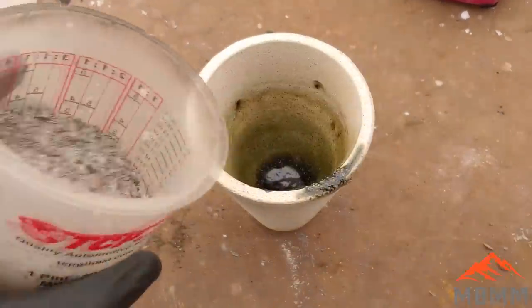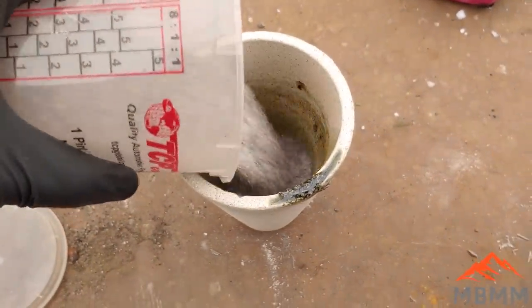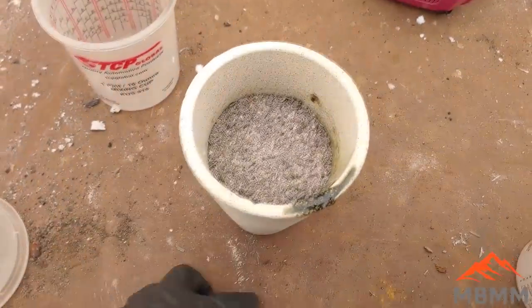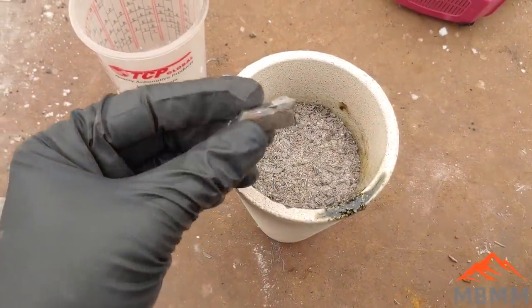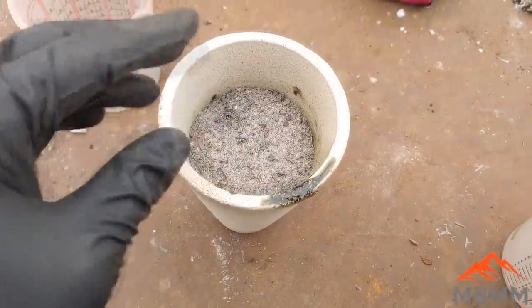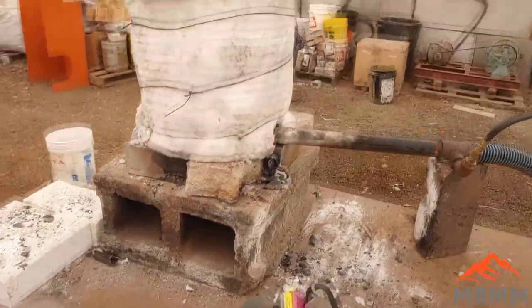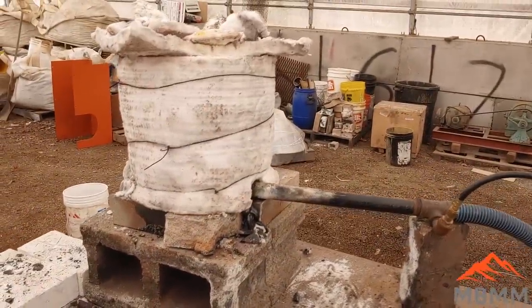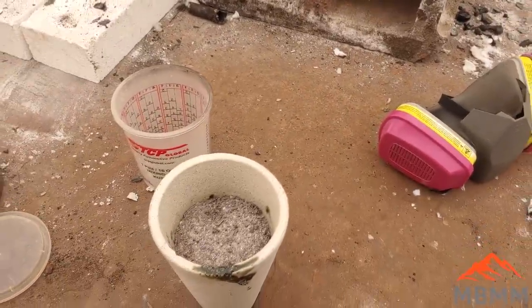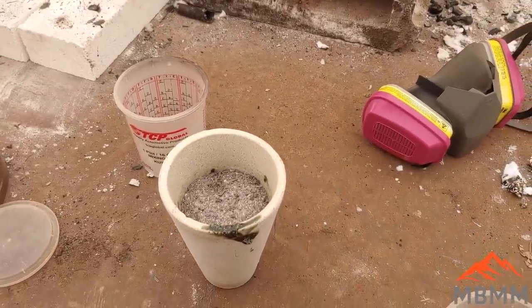We're all mixed up. We're going to put it in our crucible — I've got 26 grams of lead, I think 50 is overkill. We'll shove the lead down in there, get it in our furnace, heat it up, melt it all. Hopefully all that ceramic dissolves, then we'll pour it into our cone mold and check it out once it's cooled down.